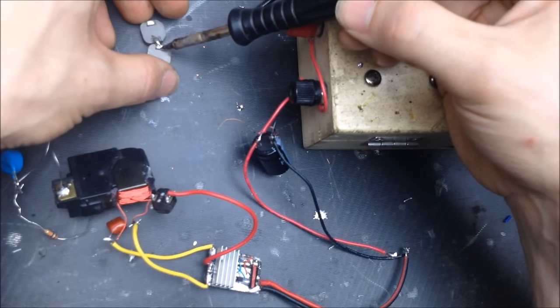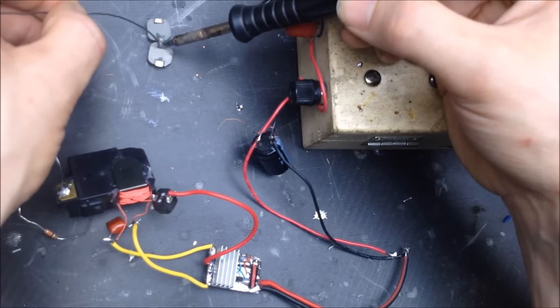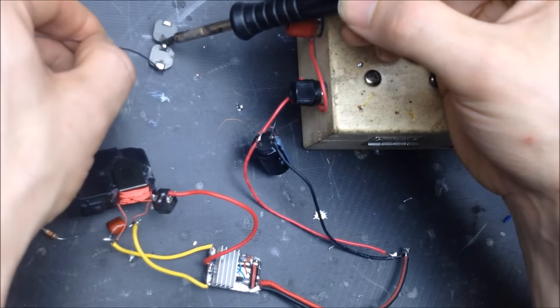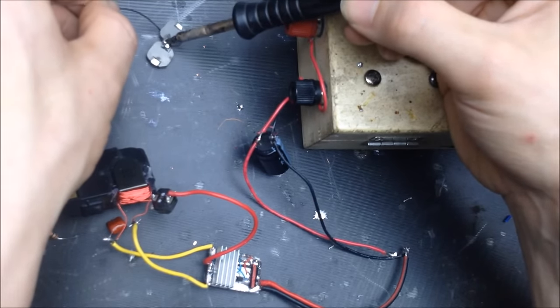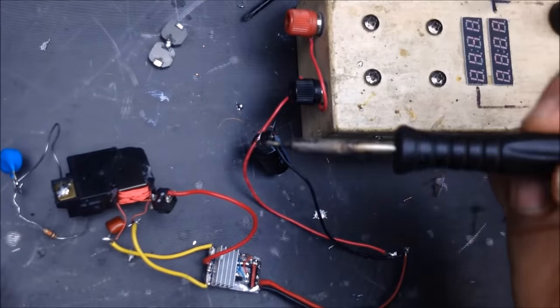Of course, with the ferrites, you have the advantage of using higher speeds, but you can still make iron inductors if needed. I mean, anything that's magnetic. You can use a piece of transformer core for an inductor if you really needed to. Yeah, those will work pretty good.